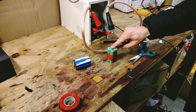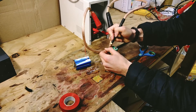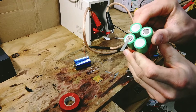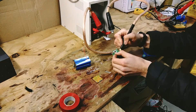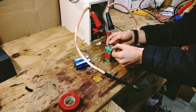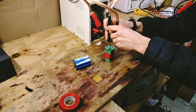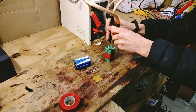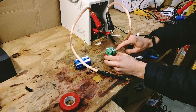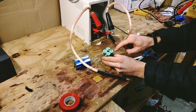This is my battery positive, battery negative. I'm going to start by attaching the BMS — that's spot welded, looks pretty good. I'm going to go ahead and do the bridge between these two using the same technique. Now a good practice is to put a little bit of an insulator between the nickel strip and this part of the battery, because there's pretty much just a piece of plastic between the positive terminal and the negative body of the battery.